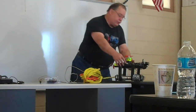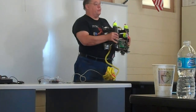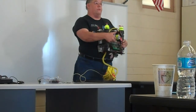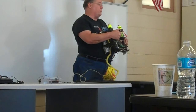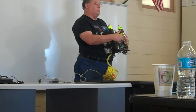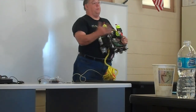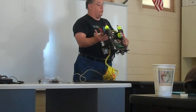Microcontroller. As you can see, instead of putting all of the controls on the surface and a heavy tether, I prefer putting the power and the control processor on the ROV itself. I use an Atmel chip because that's my favorite. I'm going to try it with a Microchip someday in order to support the sponsors. But the chip is designed to push or pull 20 milliamps out of every single pin. It's supposed to be able to drive LEDs directly. But 20 milliamps is very large compared to the conductivity of water. Therefore, it should also work.